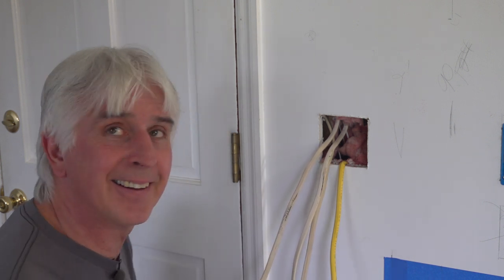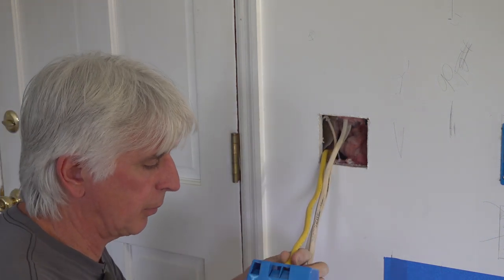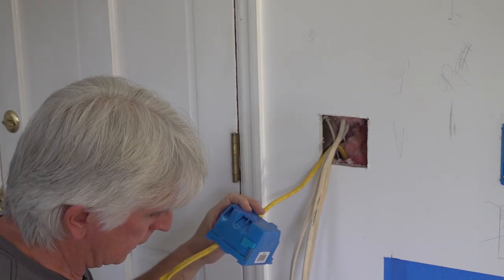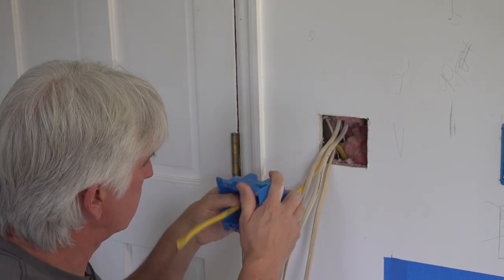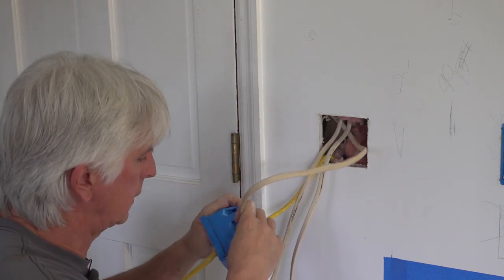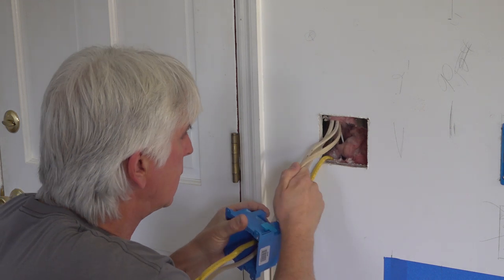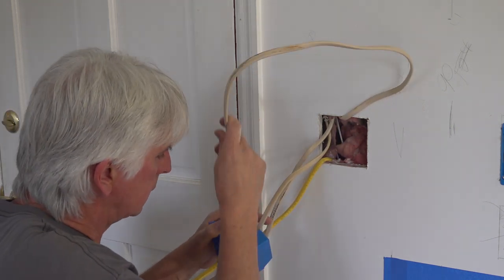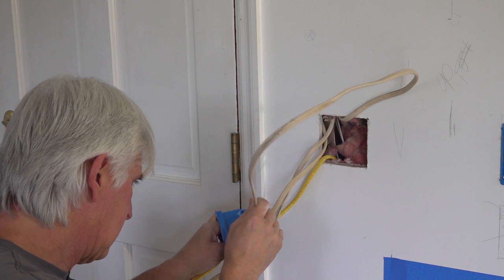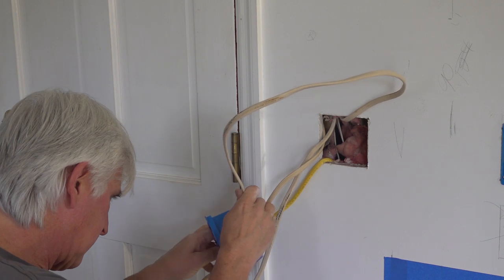They must, from what we see out there. All right, we're going to put this yellow wire — it's a 12-3 — it's going to go in the bottom of the box because it goes down. These other three wires go up: two powers and a fan. And the garage light wire is going to be over to the left. There's no real rule there; it's just what we decided to do. So I'll put the fan over here to the right. Again, you get these two power wires in here — they can be a little tricky sometimes, but you just keep working with them.